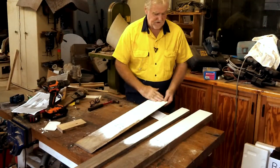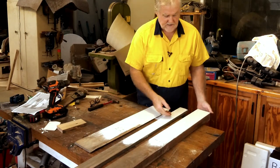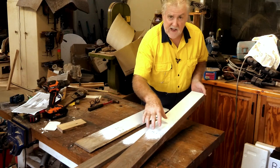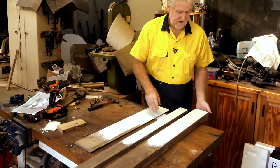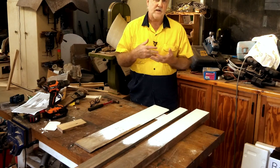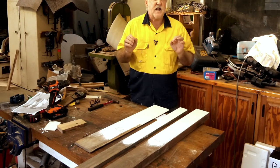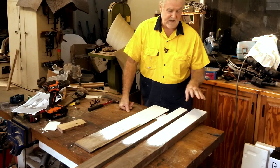It's been 24 hours — it's dry. I like the feel of enamel, but as you can see on all three boards, exactly the same thing has happened. Where we've got the undercoat, it looks and feels very nice. Where it's got just the oil-based enamel with no undercoat, it's penetrated into the wood — and that's exactly what undercoats prevent. They simply allow the enamel to sit right on the top. What enamels do is called flow — it still flows slightly after application, and that's why you get such a nice finish with enamels. I'm not advocating that you use enamels — most of you will never use them. They're hard and difficult to use; even a lot of painters don't know properly how to use enamels.